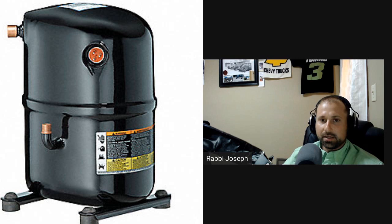That suction pressure was pretty high for an older system with a fixed metering device and lower airflow — it would be odd, especially with a crawl-space duct system on an old unit. It is a reciprocating compressor, and that's important because people say 'I have bad valves on a scroll,' but scrolls don't have valves. They can exhibit the same problem, but it's not as common. It's also a little harder to pump a scroll down because they don't typically pull into a vacuum as well as reciprocating compressors do.